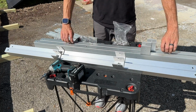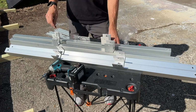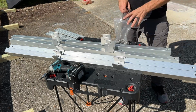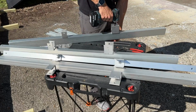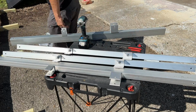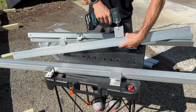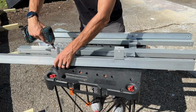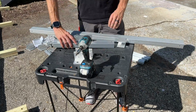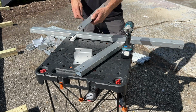But all you have to do is tighten up the lock washer a little bit, and then once that lock washer has a little bit of force on it, your impact driver will do the rest of the work, and you'll be able to torque everything down much easier than trying to do that with an Allen wrench, and it'll make much quicker work of the overall install. And then once you have the large and small U-bracket, you're ready to install these 2 pieces.